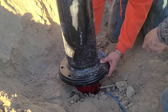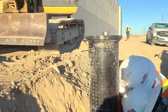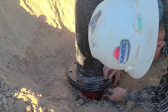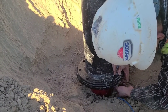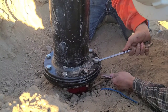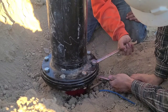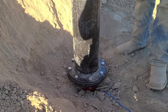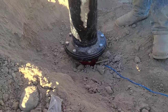Now once we have the barrel sleeve on, we're going to put the clam flanges on the bottom and bolt them up. One key important thing about putting these bolts on — the bolts that go on to the bottom of the hydrant — is to make sure that you do not over-torque them. Those clam couplings will bust if you over-tighten them, so we just want about hand tight and that's good.